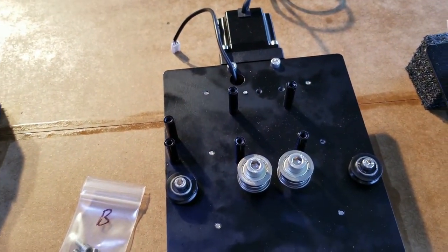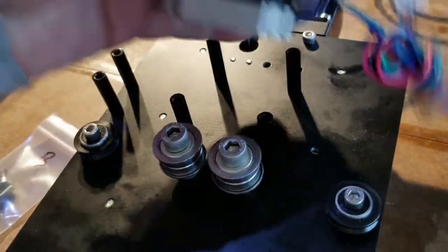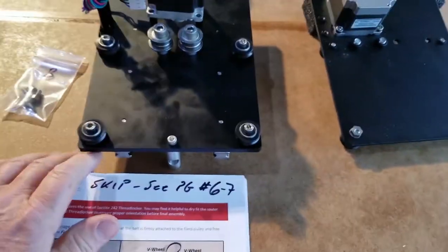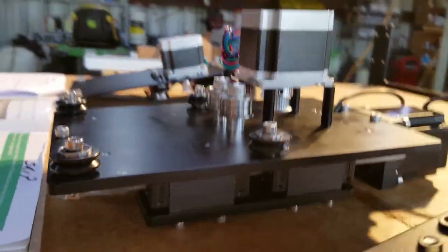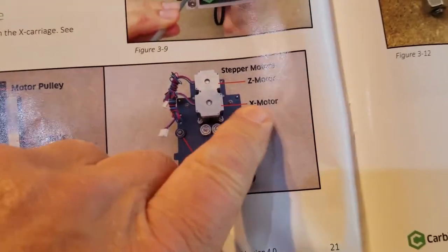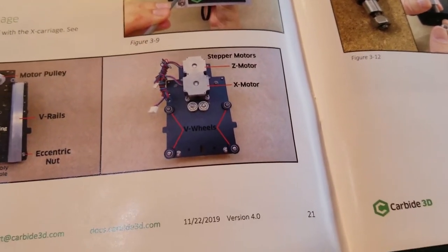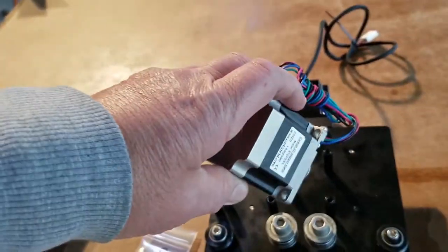Even though it fits nicely, this belt drive is pretty high and I'm pretty sure it's supposed to ride on these tensioners. Kind of makes sense if you look at it. Lines up. And then I was flipping through the manual and on the steps I told you to skip - the X motor looks like it's mounted upside down, higher than the old Z motor. And if you notice there's no label right there. So the label on this guy looks like it is going to face the top.